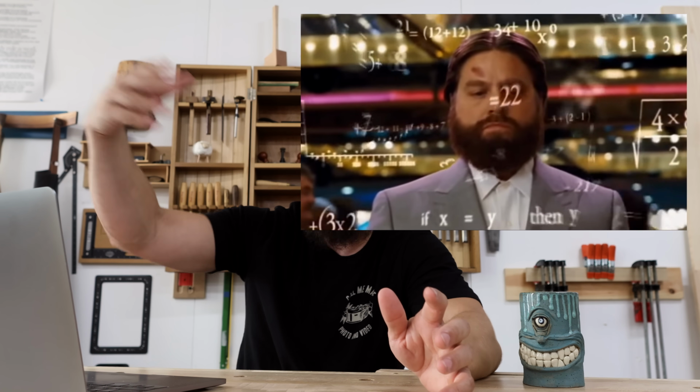Now, there's a lot of questions in here. Honestly, each one of these could be an entire 10 to 15 minute video, so I'll try to compress it. The gap I left for expansion. There's a lot going on there. There are equations that you can find online to help you calculate which species, and depending on whether it's rift sawn, quarter sawn, flat sawn, et cetera, how much those will move depending on what region you're in, the United States or abroad. So there's a lot happening there. I would say a rough rule of thumb is every 6 inches leave an eighth of an inch of movement, but that's a wild oversimplification. As far as whether or not that's standard, kinda.